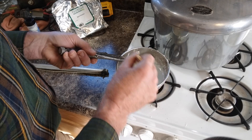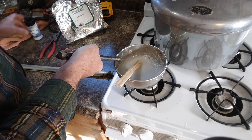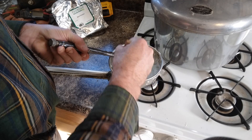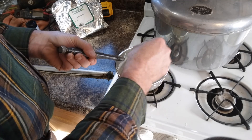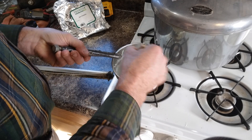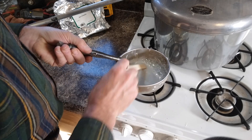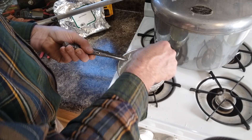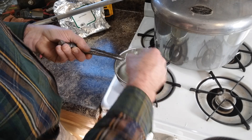What I'm doing here is melting some alum down. Alum — potassium aluminum sulfate — is going to be the electrolyte I paint on the magnesium electrode. I think John Bedini is the one who came up with the idea to use this in crystal cells, probably about 12 years ago — a bunch of guys were experimenting with them and so was I. I'm going to melt this down and paint it on the magnesium electrode with a brush. This stuff is supposed to be a little less corrosive so the magnesium will last longer, making this essentially an earth crystal battery.